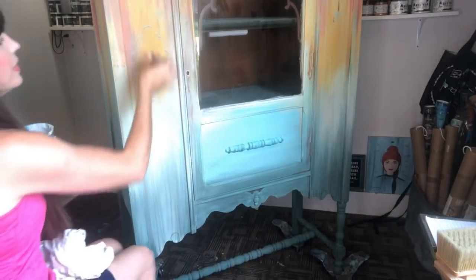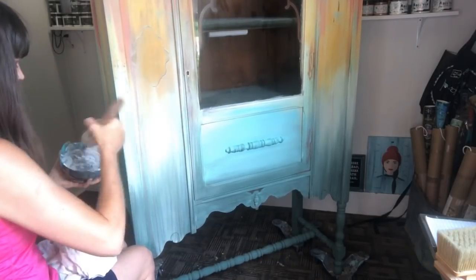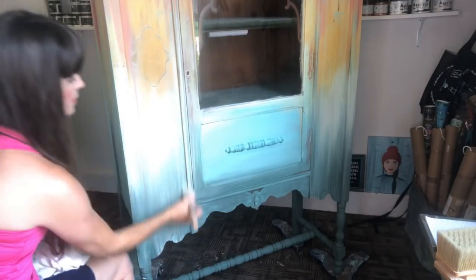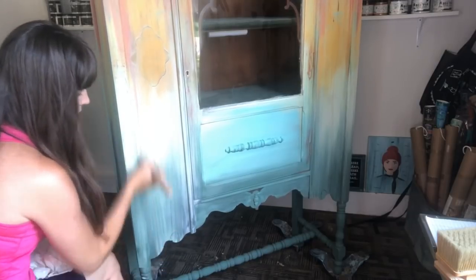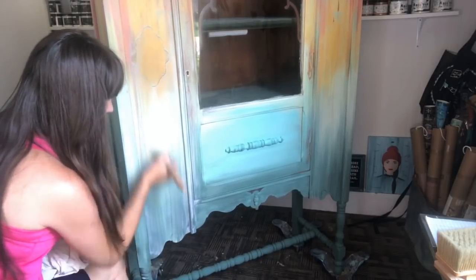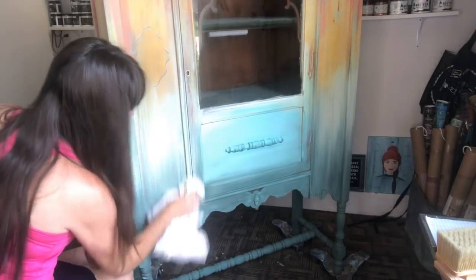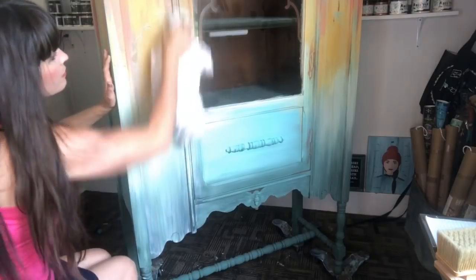I said cake. I still have to paint the top and finish that off after we get off here today, but I just kind of wanted to show you — I'm going to end up putting the white wax all over this piece. Last night I went ahead and put that wonderful Monet green color I created down at the bottom. All of the legs and spindles are covered with that and they're going to look really softened with this white wax. If you feel like you get it too heavy, don't worry — just take your white cloth and go over it so there's no chunks of wax left behind.